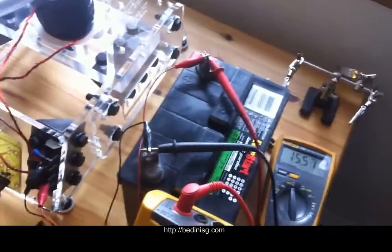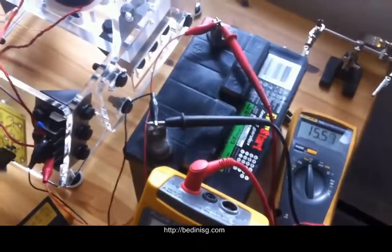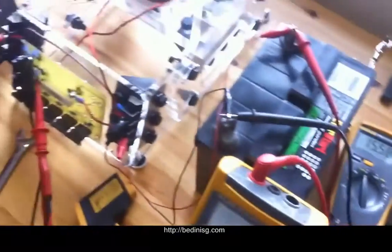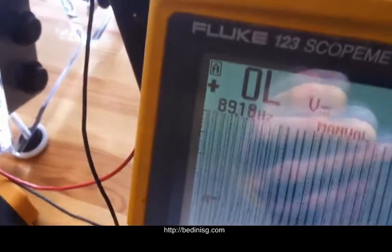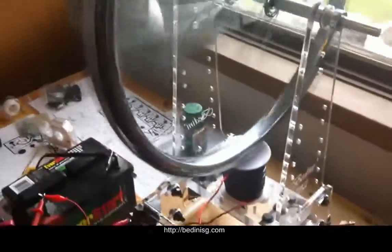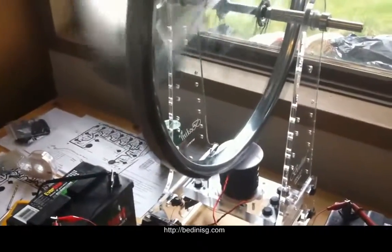Well, it might actually be about 90% or so — I still have to put it through some cycles. But you can see 15.6 volts almost, and pretty easy. So looking at the RPM: 89 cycles a second times 60 seconds in a minute, divided by 21 magnets on the wheel, equals about 250 RPM.